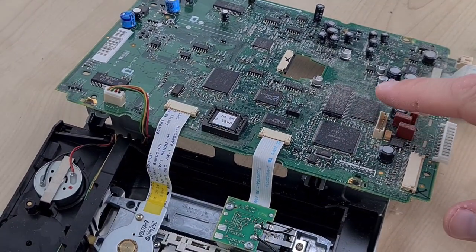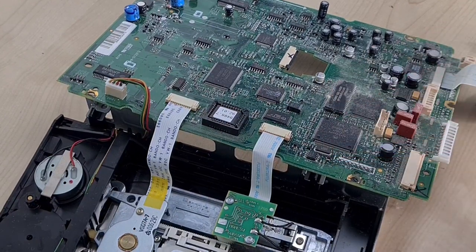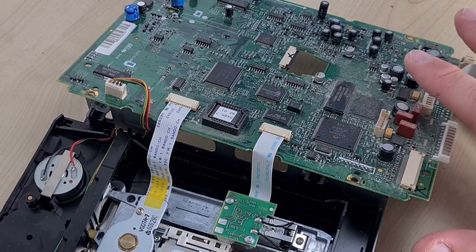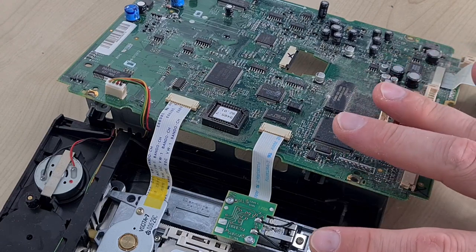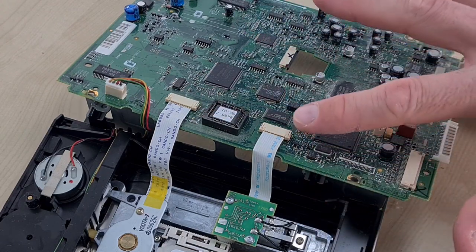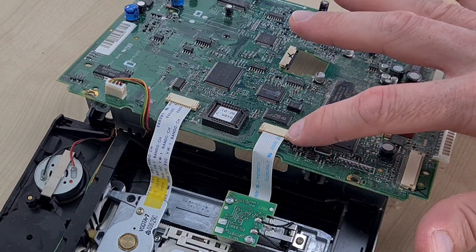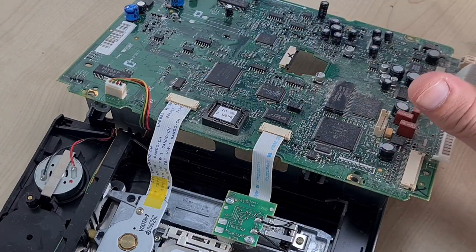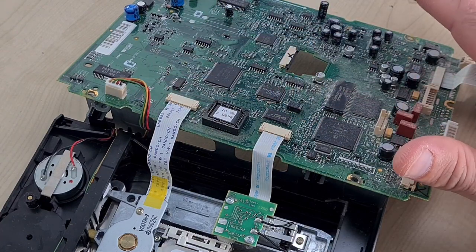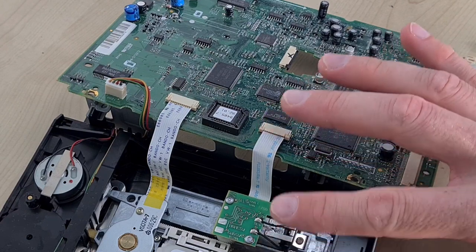As you can see, this is our actual sliding transport — there's a lot of dirt and muck in this. I'm not going to touch the laser as much as I can avoid it. Look at the level of dirt on that IC — that's pretty bad. Dust on it is fine; it doesn't really do anything other than potentially going back into the laser once we've cleaned it. I'm going to completely disconnect this board via these two connectors, the same routine — pull the little tab, remove the board, and give it a blast with a can of air.